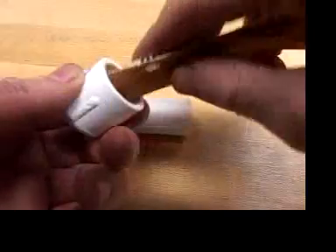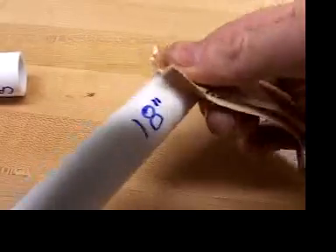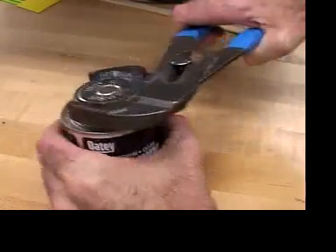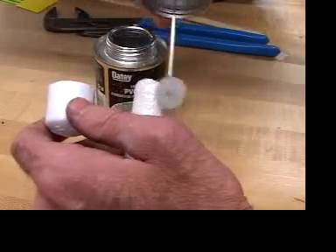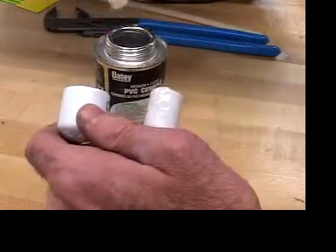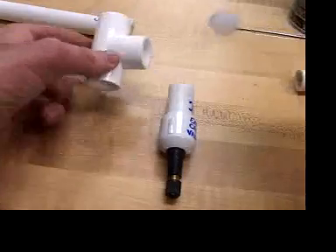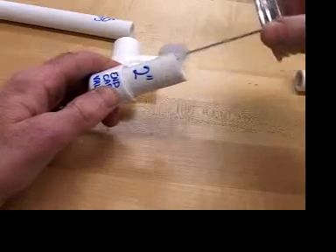I sand the surfaces — both inside and outside — that will glue together, and it seems to work, but be warned that you're supposed to use a primer before you use the glue. It seems I always have to use big pliers to get the pipe cement open, but then I close it really tight too so it doesn't dry out. Put the pipe cement both inside and outside and quickly push them together. Solvent cement is really nasty stuff and you should be doing this outside. I couldn't with darkness and rain, but I had a great cross breeze.